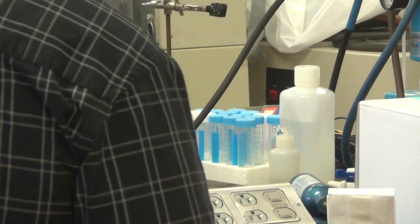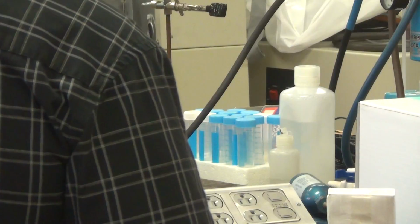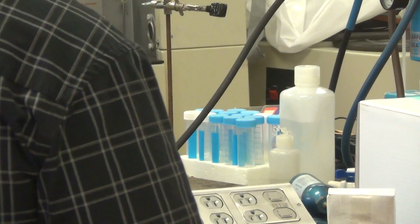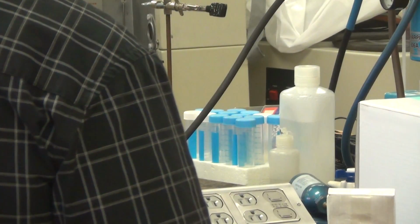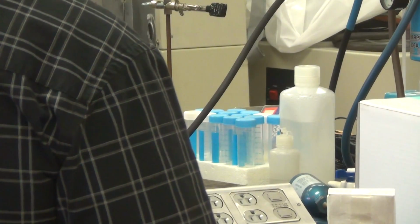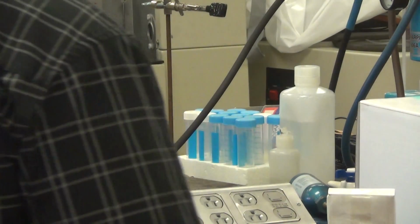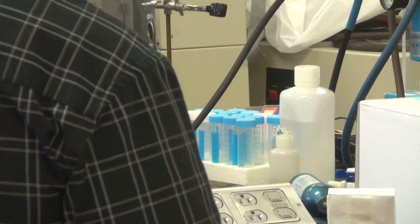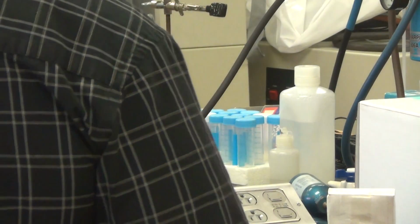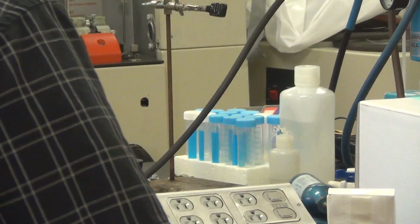check it. Okay, along the order, as you did before. You check it, because once you defrag it, if there's an error, you can't do anything about it. So you're going to copy it, delete it from here, check it, and then pack it. Packing is defrag. Archive or copy, then delete it, then check, then pack. They used to have it in the opposite, it was always real spotty. But just think of pack as defrag.